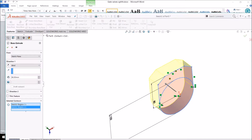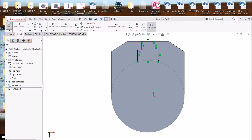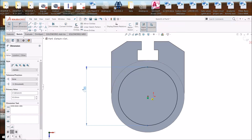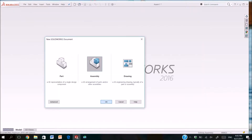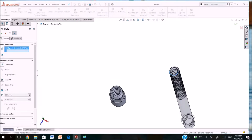This is the shape of the disc and I will extrude it, then extrude cut the shape. I will draw the circle in the middle and extrude cut it. Do the same thing on the other side. Now we fix the part that will hold the handwheel and use the hole to join the part together.